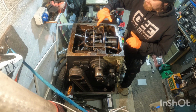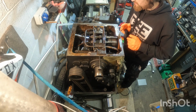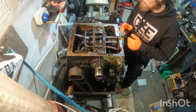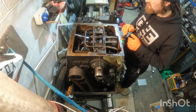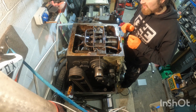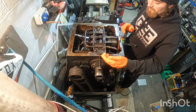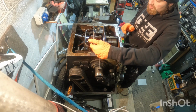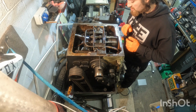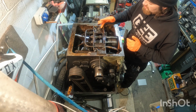Over a long period of use, you would expect some fine particles from the gears themselves wearing, but that looks excessive. So I do question whether it's been contaminated, or whether the lid's not been properly installed at some point in its life and it's got a load of grime inside, or perhaps the wrong oil's been used. But it's extremely dirty throughout the whole gearbox.